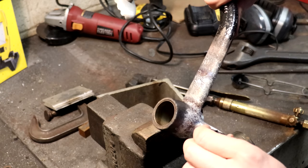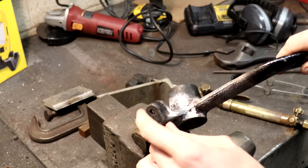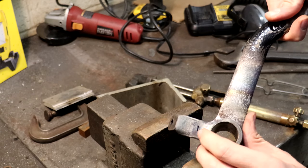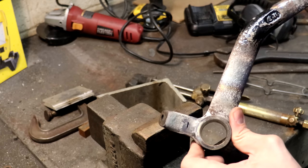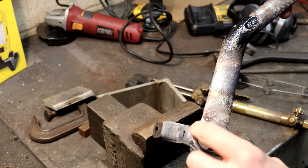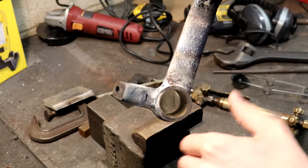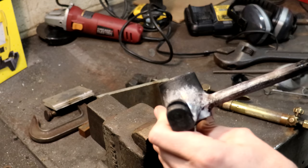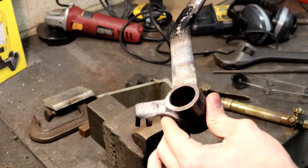So I was trying to heat this up and then bend this tab out a little bit further away, and bend these tabs back straight to get a little bit more distance there. But when I was doing that, you can see it kind of cracked here on the bottom. So I'm going to switch gears and do what I should have done from the beginning — just cut this whole tab off and make my own tab exactly as long and positioned where it needs to be, then weld it on. This is cast steel, so it welds really nicely and that should work out much better.